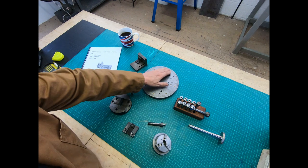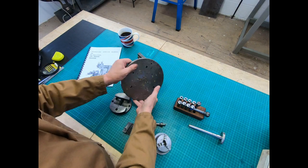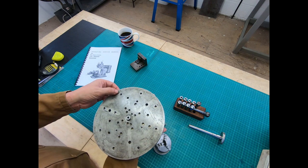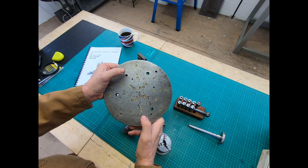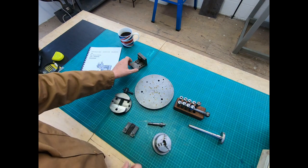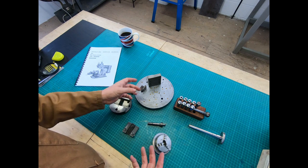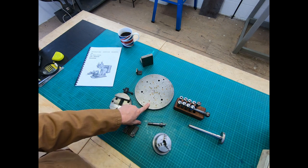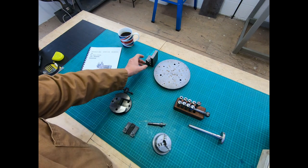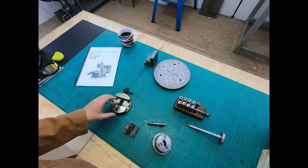So think of all the pallet plates that people make for their milling machines — this is effectively a rotary one. It fits into the centre of the rotary table. It's a fair size and has lots of holes drilled in it with little grub screws, so you can bolt anything down to it for perfect positioning. There are a couple of angle brackets that were on it when I got it, so it's quite flexible. It looks like every time anyone wanted anything special, they would just drill another hole — in normal style.